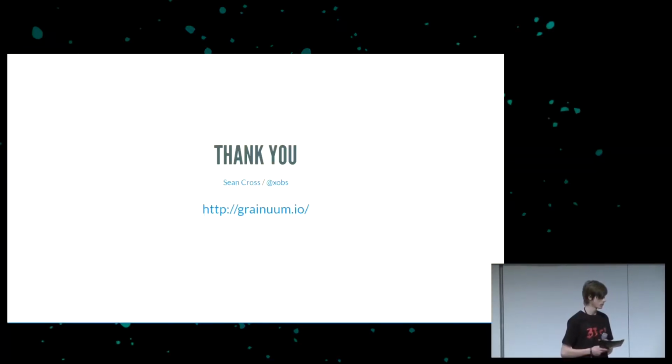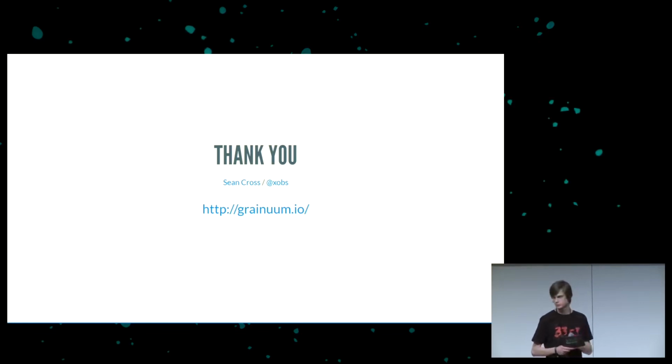If you look at the API, it's designed so that you hit an edge, an IRQ, and then you call the capture function. But it's kind of a top half, bottom half thing. The top half deals with handling the interrupt and sending the response back. The bottom half is designed to be running in this polled loop. So yes, you do use the interrupt edge detection to capture the signal and then send a response back, but you do all of your processing in the main loop.